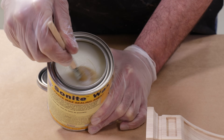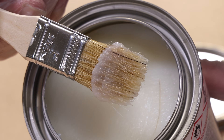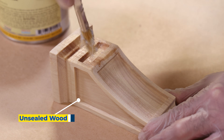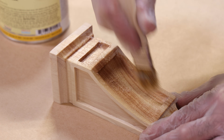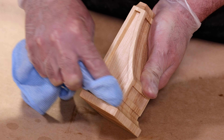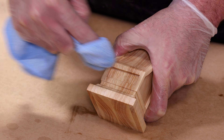This fast drying, low odor paste wax builds up quite thick on the brush and does have a high solid percentage. Don't allow this material to build up over your model, as it can change the surface texture. Excess wax should be buffed with a clean cloth or removed. A release agent is necessary when pouring polyurethane rubber against this product.